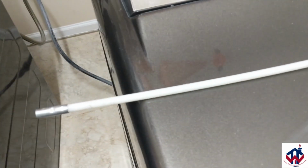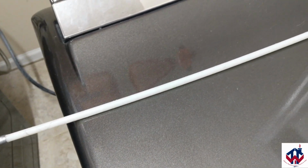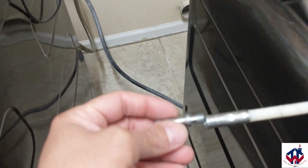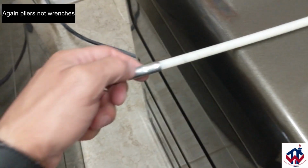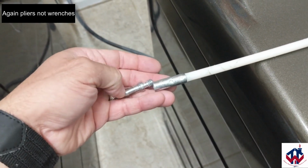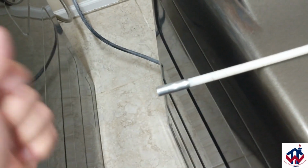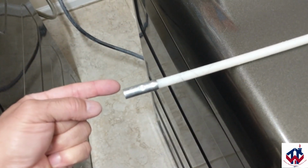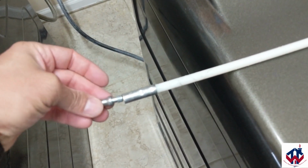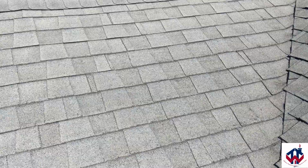And you'll see that screw piece, so you have to take that off. Now when you're starting to use that drill, it's going to tighten this down a little bit. That's where these 2 wrenches come in handy, where you have one right here holding this in place, and then the other one to bite down on this to turn it. You'll take this off, put the other one on there, and then you put this at the other pole on there, and you put this on the end of that pole again. You just repeat the process till you come all the way out.